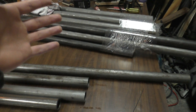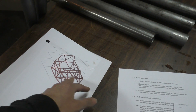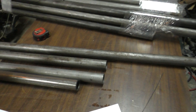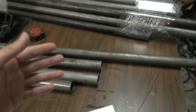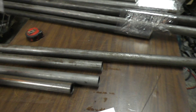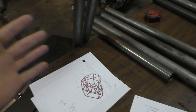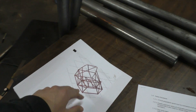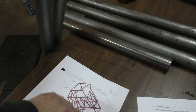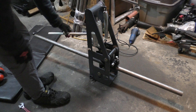For making the chassis, I ordered all the steel tubes already cut to size, so they're at the appropriate length — that cuts out a lot of my work. But I still need to do some notching, shaping the ends so they fit onto other tubes properly, and I need to bend a few tubes. I'll start by bending and notching, then build the bottom part of the frame and work my way up.